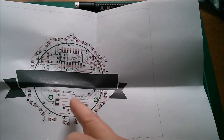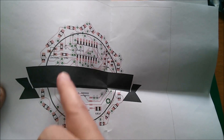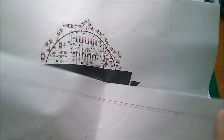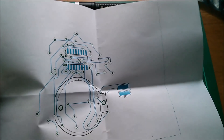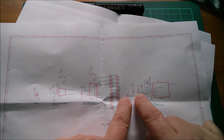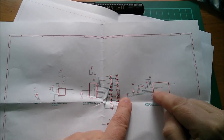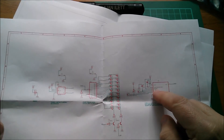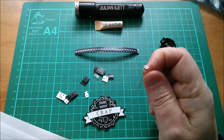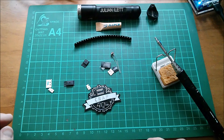There's a silkscreen printout which actually tells you more than the silkscreen does - it shows the 4017, the 555, and component values, but doesn't give anode/cathode markings on the LEDs so I'll have to check that. On the reverse side there are two pads marked with X's - that's a resistor between pin 7 and 6, which sets the speed of the 555. David has chosen to do it with an LDR, so changing the light level changes the rate at which it flashes around all the LEDs. Let's get stuck in and start building the crap badge.